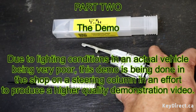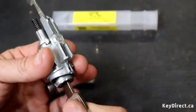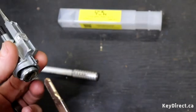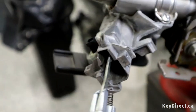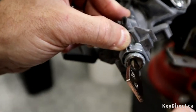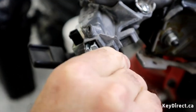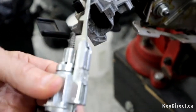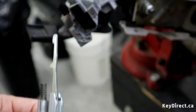Okay, we're over here at our ignition now. We've just rebuilt this one so it's turning — got a new key, repaired ignition. So typically what will happen is you'll get back to the vehicle and you'll go to put this in the lock, and your perfectly working ignition is not turning. That's from the spindle being pulled out of the location it's supposed to be in. It works perfectly fine outside the ignition, but put it in the ignition and it doesn't turn.